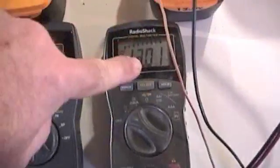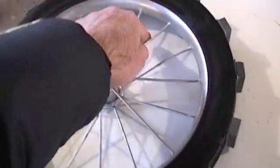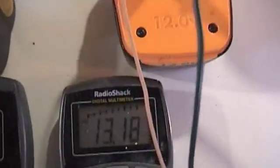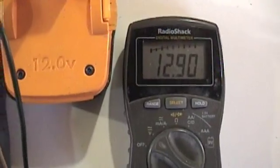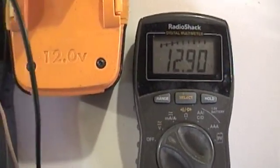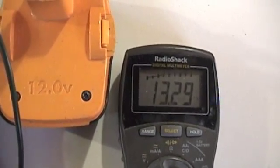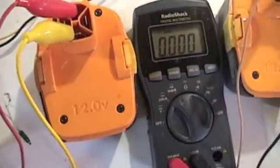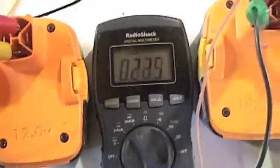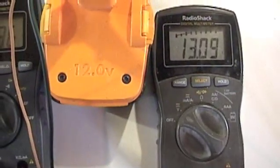Here's where the confusion comes in. Here are the volts on this charge battery — 13. Starting the motor now. We're getting power into the charging battery. Look at the volts go up. The battery that was the drive battery, now we're going to charge — it's at 12.9. This is the battery that we just charged; we moved it to the drive position. We've got our charge battery hooked up, no draw on the drive battery. There's the amp draw on the new drive battery. Here we go charging.